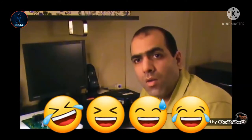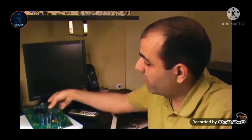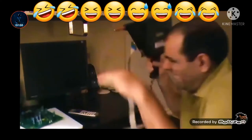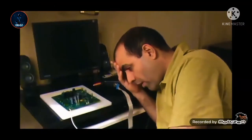The tip of the gun here simulates a human finger. Always be careful with your tools. Now, they usually zap a completely assembled unit, but sometimes it's also beneficial to zap a bare board like this one and see what happens on the actual board. Never hold the board you're zapping with your hand, because the ESD will jump to your body through the board.